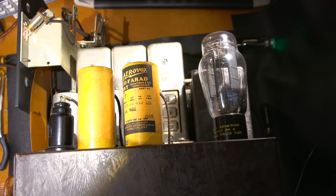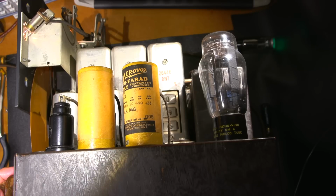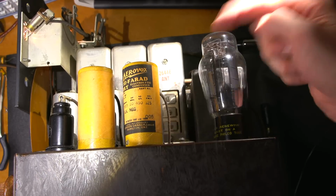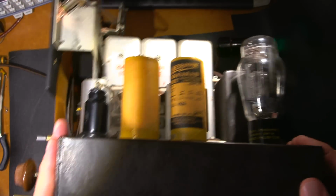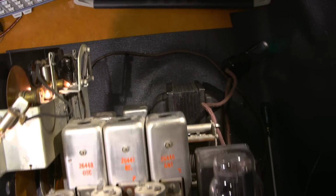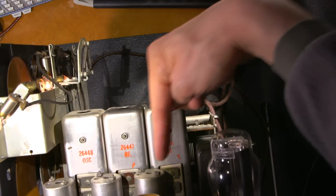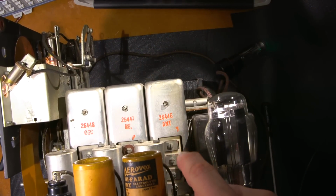So now what I'll do is I just have to go to the other bands and do the exact same thing, just basically rotate the band switch here, like that, and then go to the next band and tune it. So I'll start at the bottom, I'll start with band X, and that's these adjustments here in these cans. Here, I'll see if I can show this to you. Well, this thing falling off the bench, this ridiculously awkward thing to work with. That's tuning these right here. And then I just have the rest of them to tune, which are here.